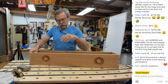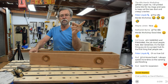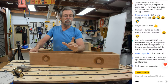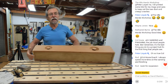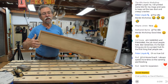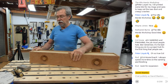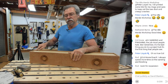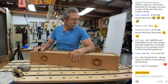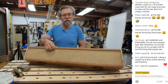I'll just do that. So I thickness the kauri down to 6, put the flat top blade that I've got, the Torquata blade, that box making blade that I've had for years, and pop that in the saw, dressed everything, got it all working. I haven't put any slots in the end because this is only 11 millimeters. And honestly, that's not a big span. What I might do, I probably won't, is put a glue block in here to support it, but it's really not going to go anywhere. It's not going to do anything. It's in, it's glued all the way around inside there as well.